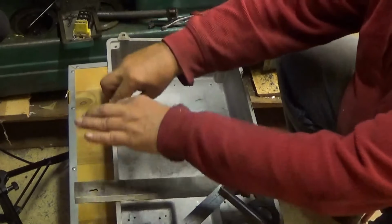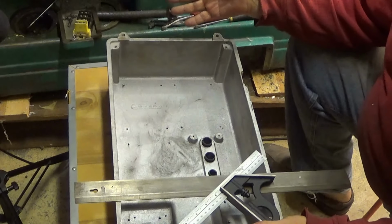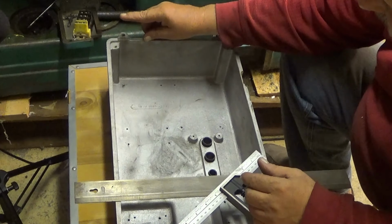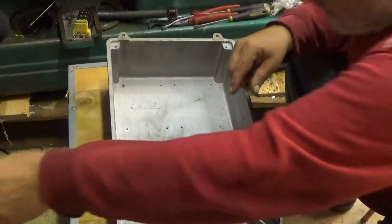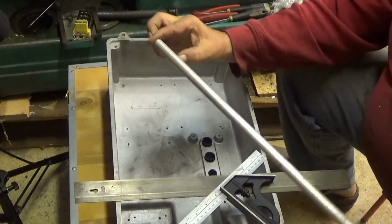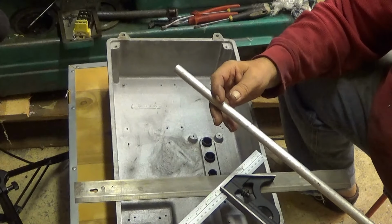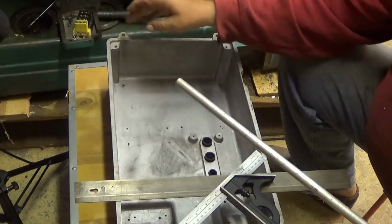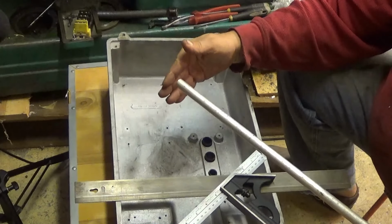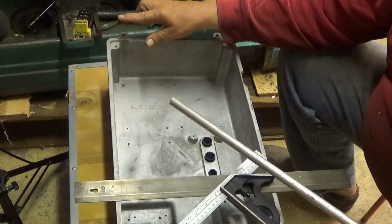First of all, I decided not to use a wooden frame here, simply because this is easy, actually. You just make the correct sized riser here. I have here some 16mm aluminium, and just make pieces out of this. Bore a hole through, thread it to M8, and then use some bolt and cut it from each end, and then screw it there. And then you have it a little bit higher.